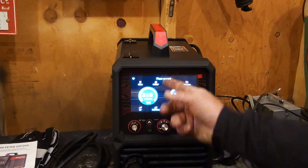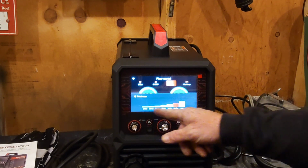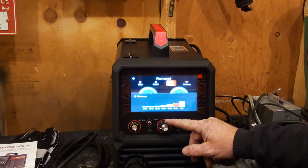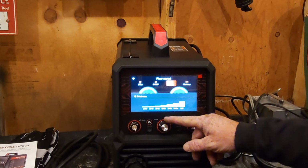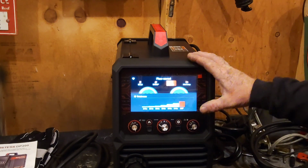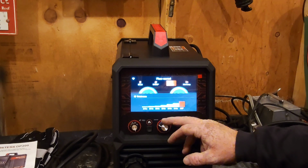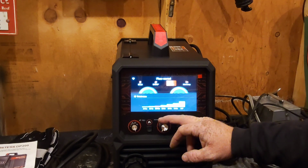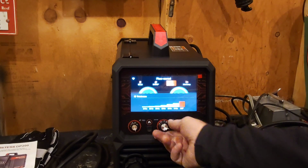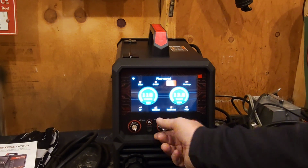Then you're going to go to your metal. This is your little thing. It shows you how thick it is, whatever. Well, no it doesn't. That great big one's 1/8 of an inch. The settings are knocked down because it's detected it's on 120 volt. So we can go down to like 20 gauge. There you go.